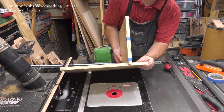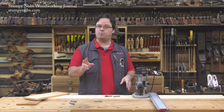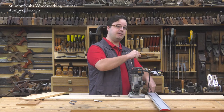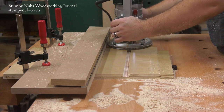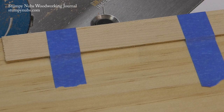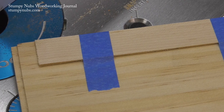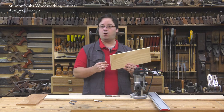If a sliding dovetail joint is excessively wide, it can be nearly impossible to assemble, especially when glue causes moisture to swell the fibers. That's why wide joints are better tapered. A tapered sliding dovetail fits together loosely at first but tightens as the tongue fully slides in the socket. After cutting your dovetail socket, move the end of your edge guide at the back edge of the joint away from the socket by a sixteenth of an inch — pivoting the other end in its original place — then take another pass with the dovetail bit to taper the socket. For the tongue, tape a one-sixteenth inch thick shim on the face of the workpiece near the rear edge of the joint, keeping it high enough so the router bit won't hit it, then run both faces just as before to create a matching taper.